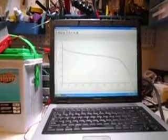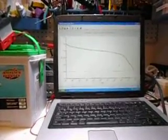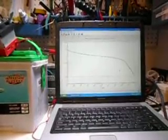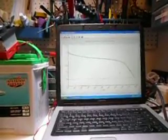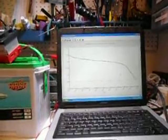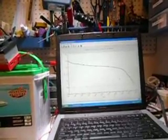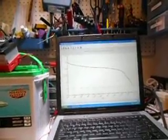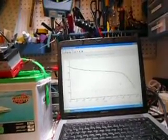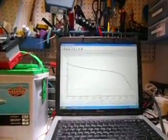Tonight again I'm going to restart this whole thing and charge the battery. I think I'll charge it a little bit longer on the straight 2-amp constant current — what I believe would be called the plate forming charge. It's now 9 o'clock at night; I'm going to charge it until 7 or 8 in the morning at 2 amps. Then I'll put the Bedini on to pulse and top the battery off, and we'll do another charge-discharge tomorrow night.